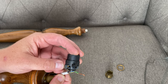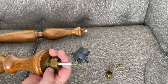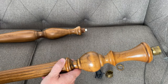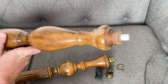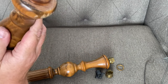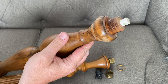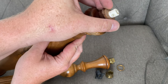So I will disconnect this with a screwdriver and pull the cable out and through, and then we'll start threading through the new gold one. So that's unscrewed and disconnected now, so we can just pull through the old cable — pull that from the opposite end all the way out, and then same on this part here that has already been disconnected. Also on the bottom there is a cord retaining nut as well to stop you from pulling it through. So once these two sections are assembled together and everything's wired up, we can lock the cable in place just before we attach this to the base.